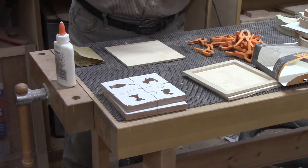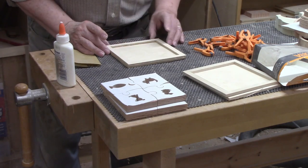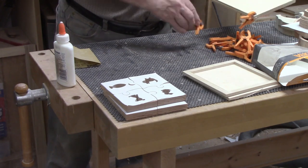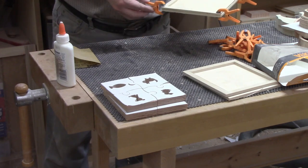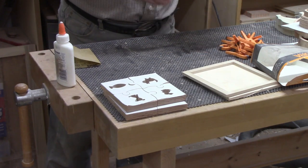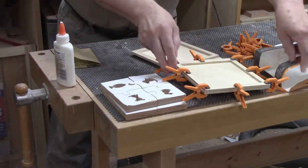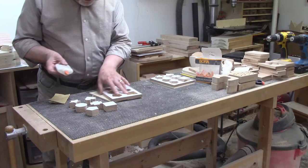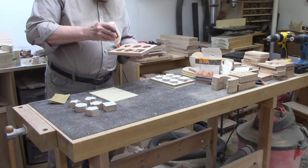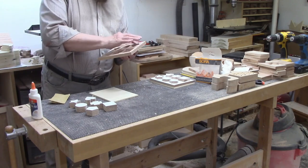I used a small glue bottle to squeeze a thin bead of glue onto each side of the frame. This white glue is water-soluble, so I used my finger to spread it around evenly. I purchased a set of mini spring clamps specifically for projects like this. I started with one clamp in each corner, then added a couple to each side. These clamps are quick and easy to apply and give enough downward pressure to hold the two surfaces together while the glue dries. You want to make sure to use enough clamps on thin materials like this, because the moisture can cause the wood to warp and leave gaps. The last glue-up step was to add the backer to the frame for the geometric-shaped puzzle. I used a glue bottle to place a bead of white glue on the frame, then used my finger to spread it out evenly. This glue is water-based, so I can easily wash off any excess with a paper towel.